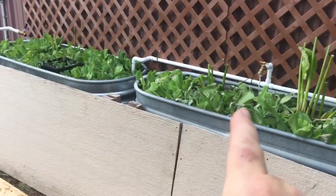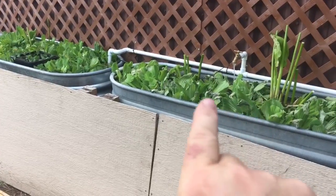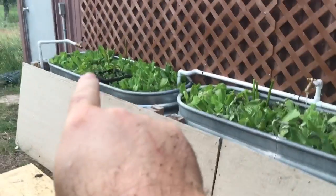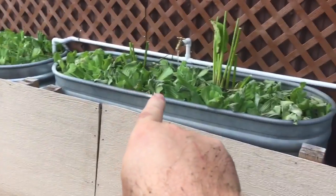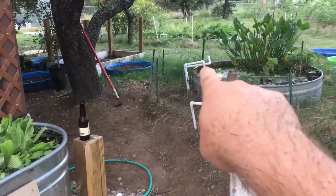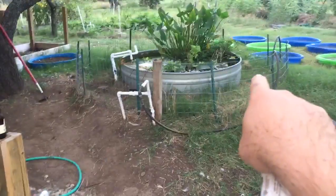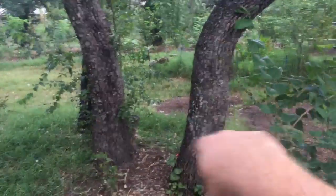But if we're drawing from one, giving to the other, there's a time, and if we go faster than that equalization can happen, that tank starts to drain, this tank starts to overflow, the head pressure increases, that increases the flow of water there, that overdrives that standpipe. This tank and this tank overflow, this tank gets low, that tank overflows, that thing gets low, the oh shit valve goes off, everything tries to equalize again, and eventually we lose a lot of water from the system. That's not what we want.